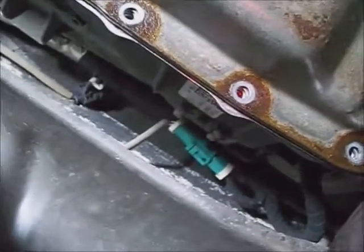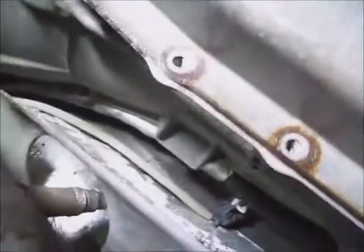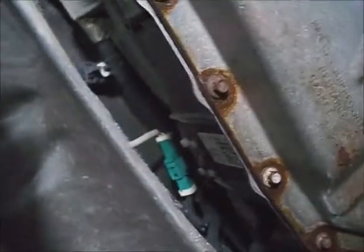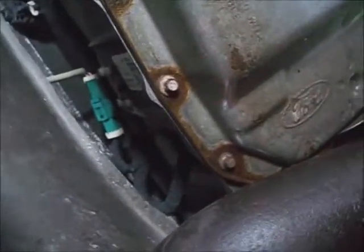I've got two bolts started, one in this corner and one back over here. Get all the bolts started before you tighten any of them down so all the holes will line up. I've run all the screws down lightly with a cheap quarter-inch screw gun set to slip on the easiest setting. Now I'm going to start tightening them down to 106 inch-pounds, working from the center out in a diagonal pattern.